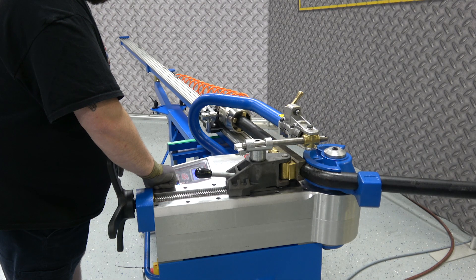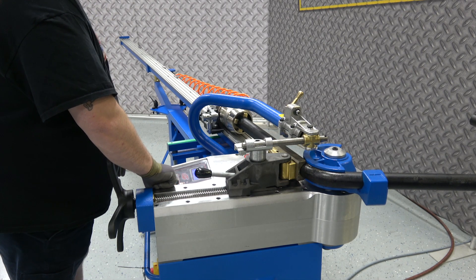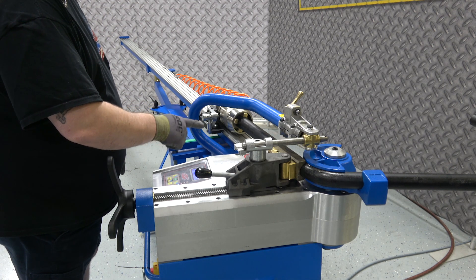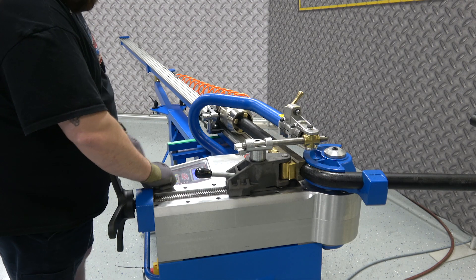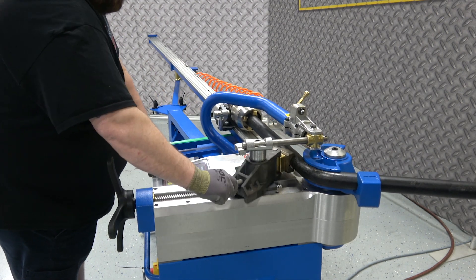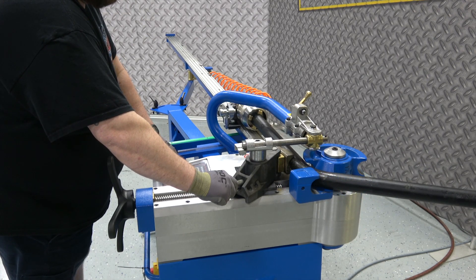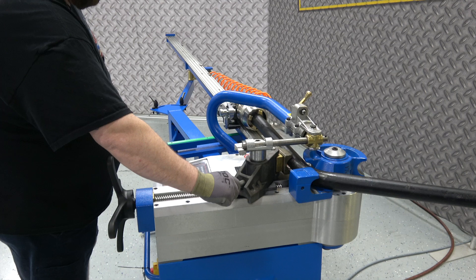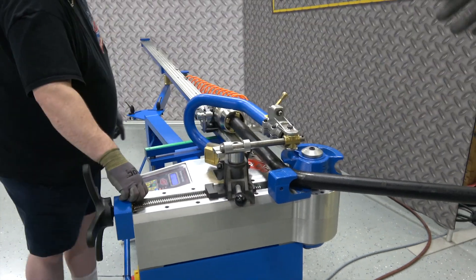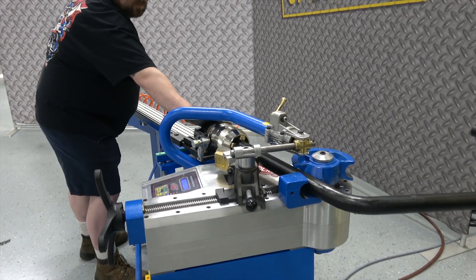We're making a nice part — it looks like a two-step rail. We wanted 60 degrees and that's what we got. Now watch what he does with the vise — he just keeps it in place there, keeps that material in check as the former comes back. That's the bend. He swings it away and he's ready to go. Now if he chose, he can pull the table forward again to advance the material. He can come around — there we go.